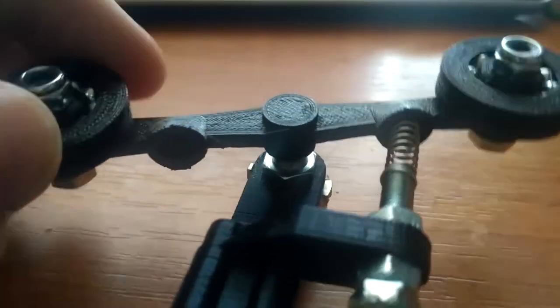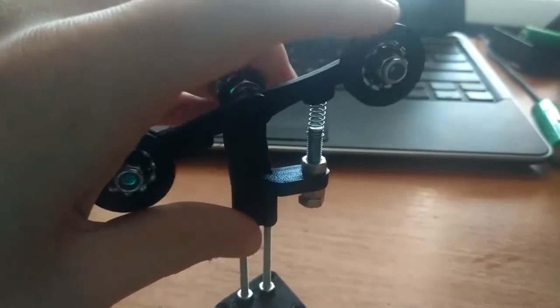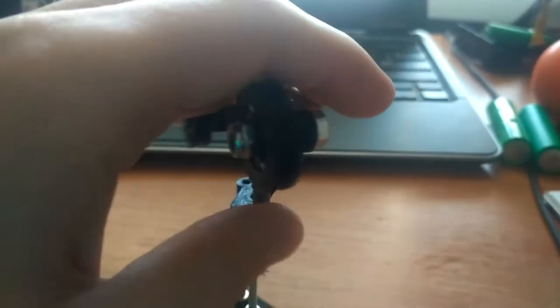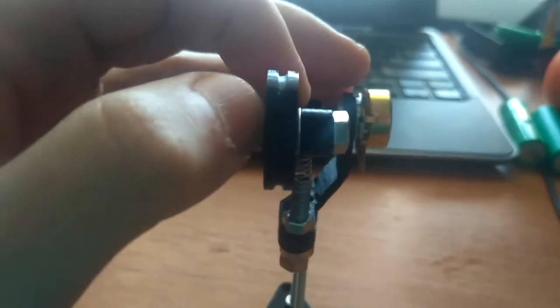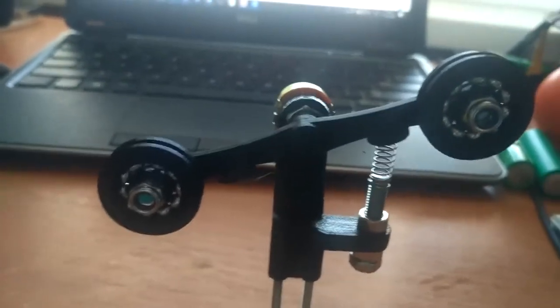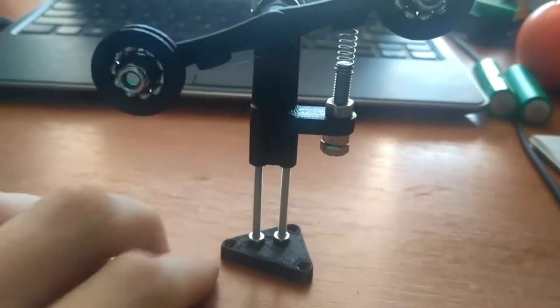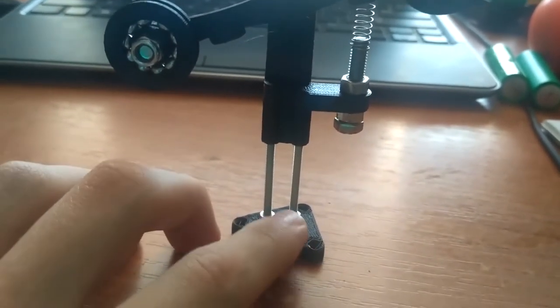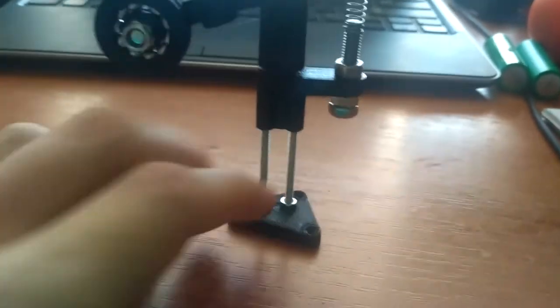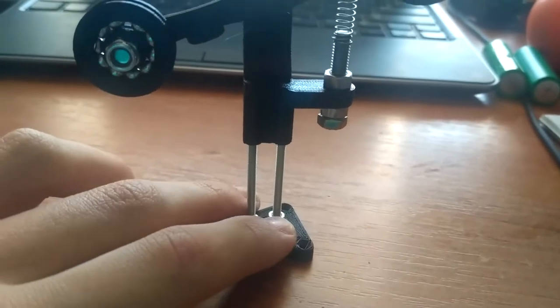On the bottom there is a hole for the spring on either side so you can clip it however you want, and it just snaps like that. For the bearings — I forgot to mention — I also added a U-groove that is about 2 millimeters in diameter so the filament should find its way inside and shouldn't slip from the bearings. The whole thing is made up of three components: the stand, which will be attached to the wooden plate that will hold the entire extruder.